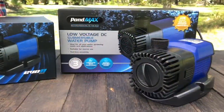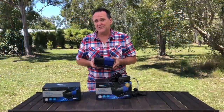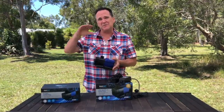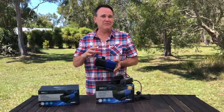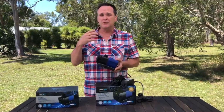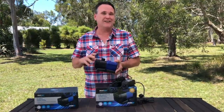And these pumps aren't just efficient, they're smart too. They all feature soft start. That means the motor starts slow and then the speed ramps up. That avoids that typical jerky starting motion that you often get with pumps, and that recoil can actually cause pipe hammer and put strain on joints and pipes. That's all reduced with this soft start.